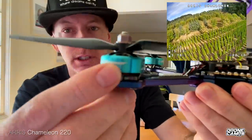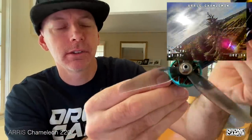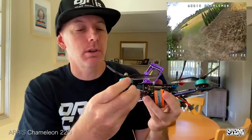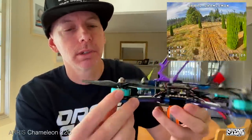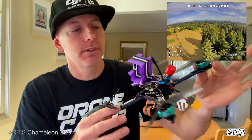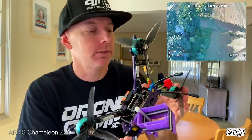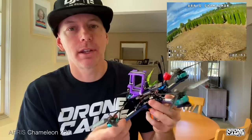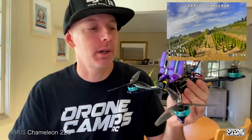I like the smooth motors — the Smooks motors, whatever they have on here. I like the finish on these motors, and they have their own logo and some pretty decent-looking stator inside. It looks like really nice copper coils — pretty thick, high-quality copper inside here. It's not real thin and chintzy copper wire, and it looks to be well-wound inside the motor. A hollow shaft through with a bolt on the very bottom, which I prefer for holding everything on. I flew this for a weekend, and after my first two or three flights, this was the kind of quad I wanted to keep pulling more batteries out of my bag to fly because of the performance. It is just extremely fun to fly.